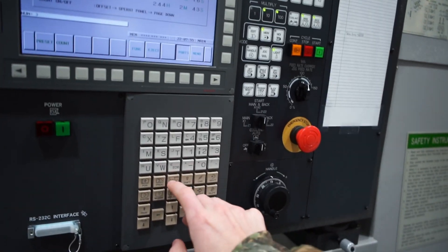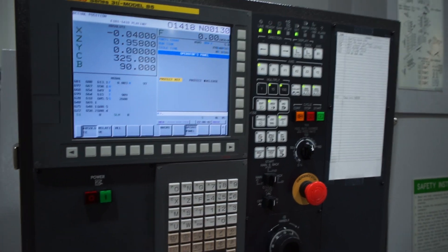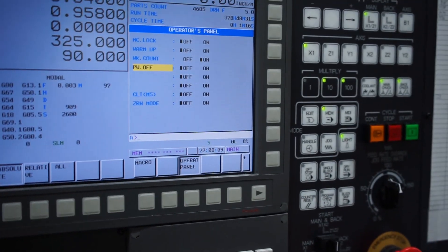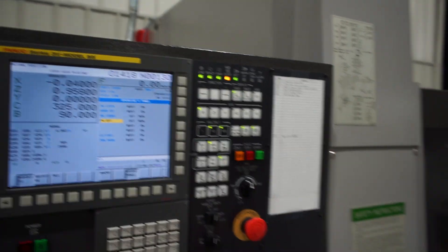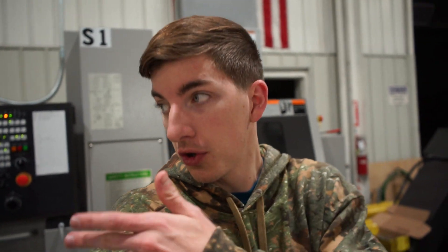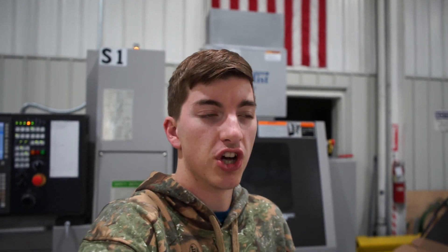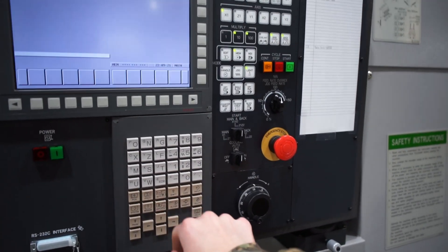After my count is set, I hit the offset key and arrow over to the operator panel, then page down once until I see PW off. I'm going to turn that on and you'll see a little light come on up here. What this does is: if any error comes up on the machine that stops the process, that power-off will trigger, wait about 60 seconds, then kick off the NC control and the entire machine, which in turn turns off the bar feeder as well. The point is so if anything stops the process, the machine turns off instead of running all night when it doesn't need to.